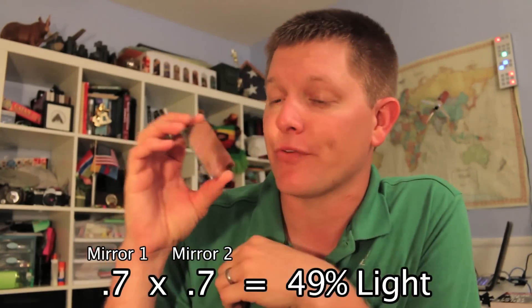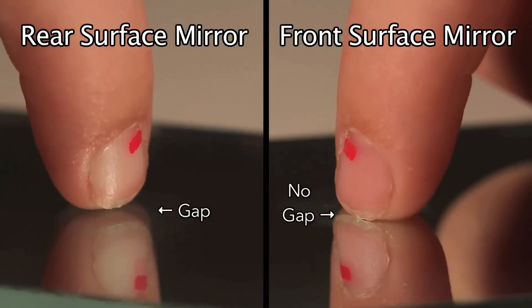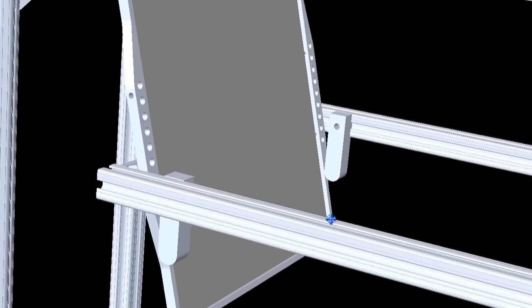All right, let's run through our failures. Number one: it was too dark because my plane came in late. Number two: the balloon couldn't pop the way we wanted it to, so we had to use a torch. Number three: we didn't line the camera up right with the armature. Number four: if you use a mirror, you'll lose about 30% of the light by the time it reflects off the surface — the solution is to use a front surface mirror, which has the reflective surface on the outside so the light doesn't have to go through the glass. Number five: the mirror slipped and banged against the armature — the fix was to put a mechanical hard stop in position. Finally, fire's really not that interesting in this setup — you've got this big nebulous flame with no real point to focus on. Even though we had all these failures, this is part of the design process, and once we worked through them, we were able to come up with this.